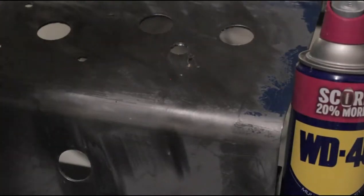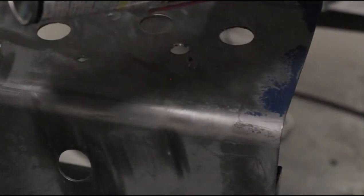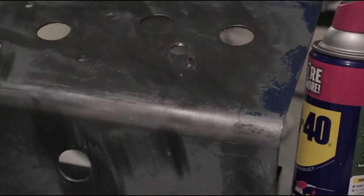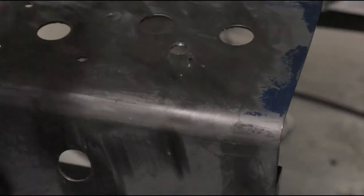Let's see if I can drill these new holes and see how it turns out. Another thing to keep in mind: you need to lube up the drill bit on metal, it just seems to work better. Everywhere I read online says to put WD-40 on it as you're doing it, so let's see what happens.